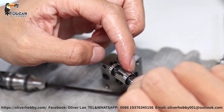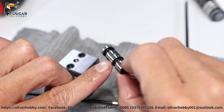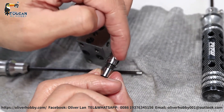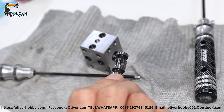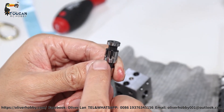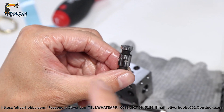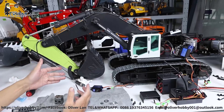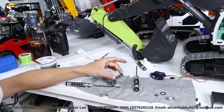Looking at this side — 180 degrees corresponds to the return line. When turning in reverse to the other side, that corresponds to the other V-shape. They are 180 degrees apart, corresponding to open and close for inlet and return line. That's the V-shape design: slowly opening the oil inlet, and when the V-shape turns the other way, slowly opening the return line. That's how you control it — the oil goes to the cylinder and slowly speeds up. You can control with even a cheap radio and slowly increase the speed. That's the smart design of the V-shape curve that opens the valve channel.